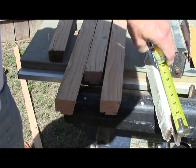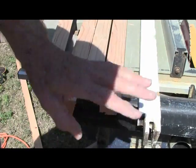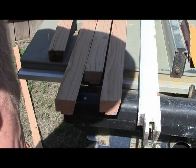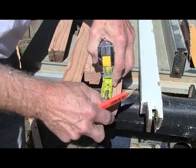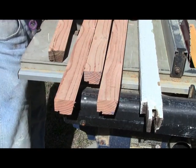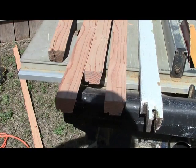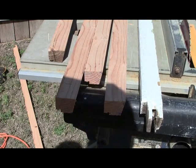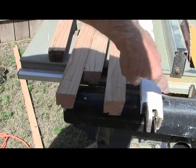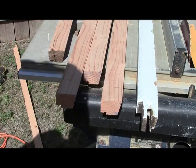This end here shows to be two inches, so what we're going to do is mark two inches on both sides, and then when we cut it back we'll cut it back to the length that we need. Now we got them all marked two inches. We don't necessarily need to do the test pieces because all we're doing is just getting the distance from this edge to our first cut — that's all we want with them.